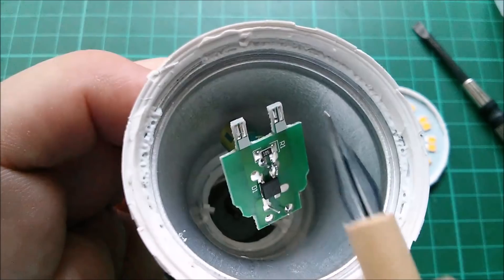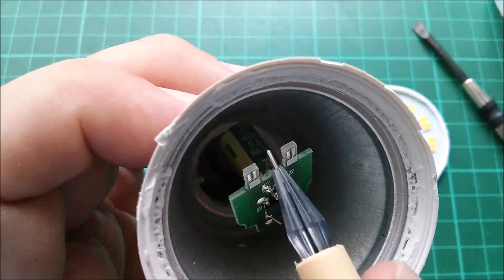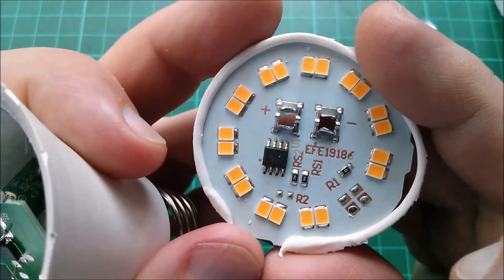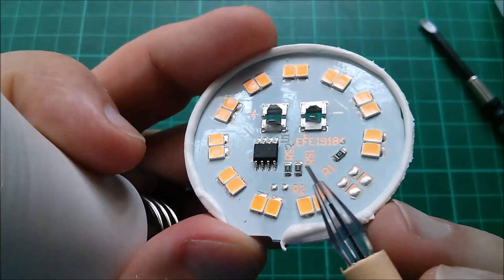There's a 105 — which is a one megaohm resistor — across the capacitor, so that it discharges moderately quickly once the mains power has been taken off. Then that high voltage DC, which should be about 300-something volts once rectified and smoothed, goes into this board.